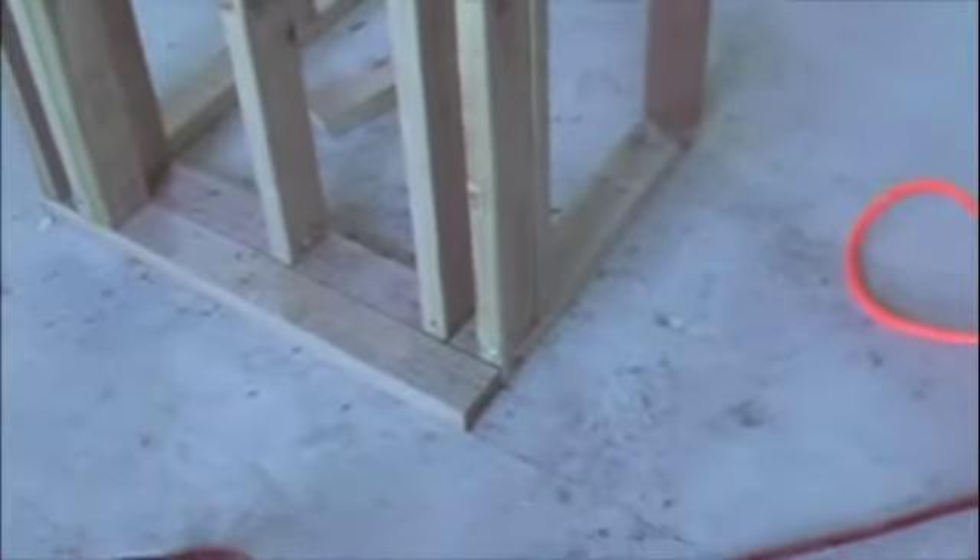We recycled some of the headers, so to speak, from the wing walls that I dismantled. We've got bookcases — one here, it'll be eight foot tall; another one here, it'll be eight foot tall. And Joel's standing in the spacious closet. We've got a double wall here for the purposes of the pocket door, so I'm going to cut out that first plate, obviously. And again, that recycled header — you can see there — which is important.